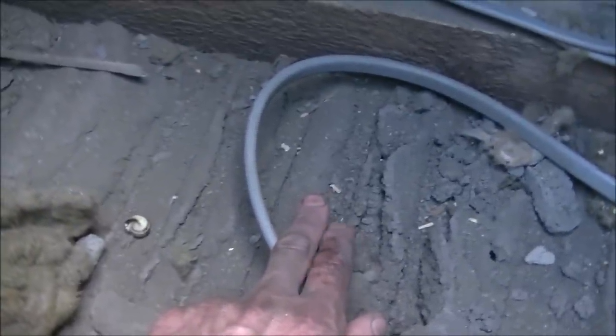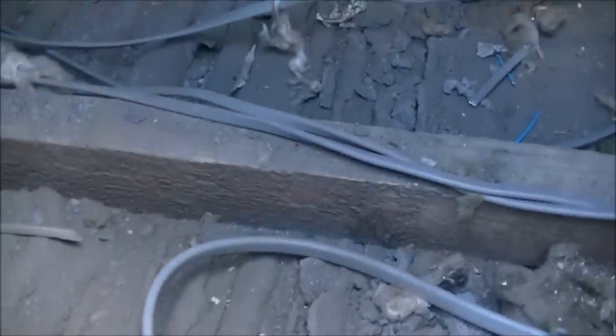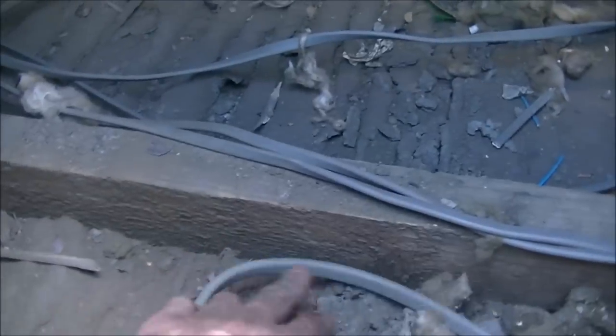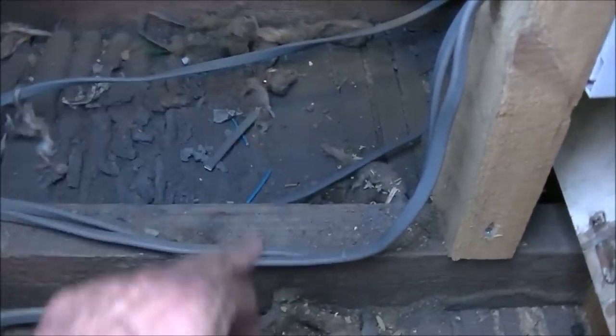I'd like to show you my view when I'm walking in and out of this attic. I'm just rolling up all the insulation and trying to get it back to the floor — back down to this, which is lath and plaster. Now downstairs I've actually underboarded in the past so there's plasterboard under this, so that's not a problem. Obviously the thing to bear in mind is the new joists I'm going to put in — I'm going to put them next to the existing joists. They're going to be a lot deeper but I've got to get them down flush, and they're going to rest on a structural load-bearing wall which runs pretty much along the middle of the attic and then along the two wall plates either side of the house.